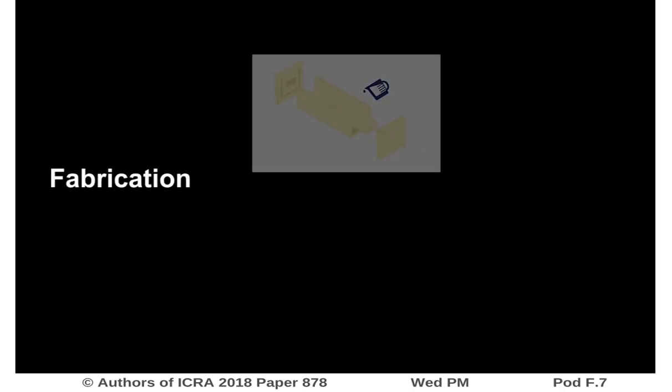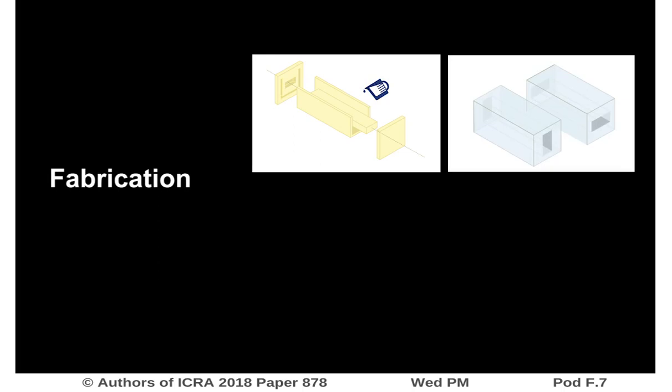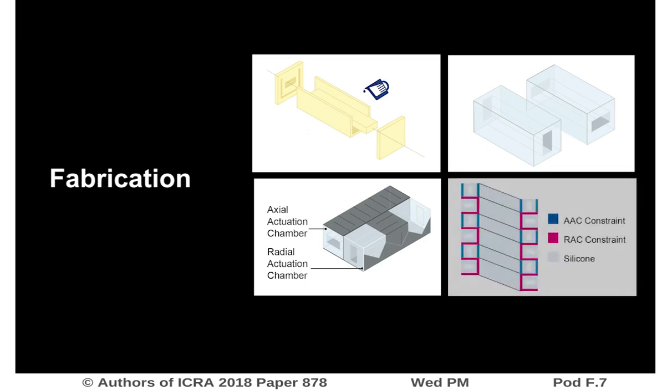The elastomeric strands were made by 3D moulding. Each strand had a length of 60cm. Polyester sheets were embedded in each of the pneumatic strands by painting them with uncured elastomer. Then the two final strands, axial and radial, were bonded together with an uncured elastomer and arranged in a helical configuration to obtain interlayed axial and radial expansion.